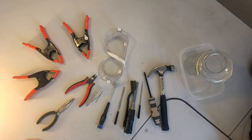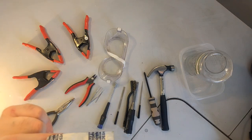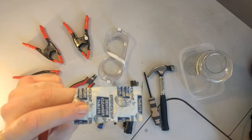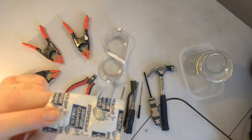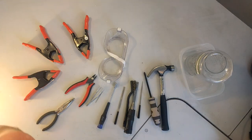If you feel like cleaning the thing while you have it all apart, I can't imagine why you wouldn't want to do that. When you take the keycaps off, you can put them in a glass or some sort of container and use denture cleanser, and that way you don't have to scrub them. All the dirt kind of floats to the top. Just steal your grandmother's, you know, maybe steal four of them. I'll steal more. She'll never notice.